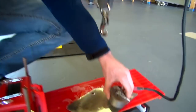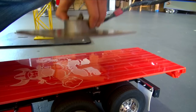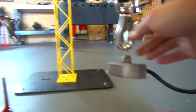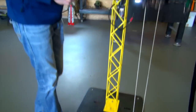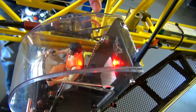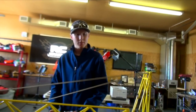We took this out — I tore it down to adjust the magnet itself, which gets warm when you use it. As you apply power it creates heat and a magnetic field, and allows you to grab. It's hooked up to the gear switch on the DX18 — it can be hooked up to a number of switches but that's the one we chose. When I flick that switch, it's just a simple on/off. We used a servo on a switch rather than an ESC. It turns a light on so the operator can tell it's on, and you can see how the servo is actually moving down there, pulling the on/off cord and activating the magnet.